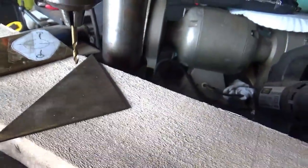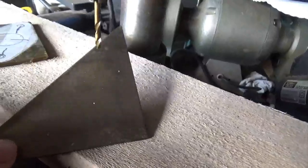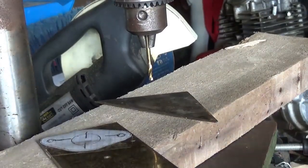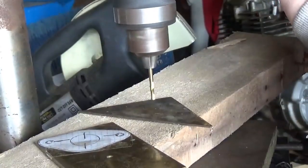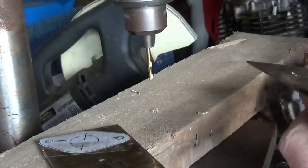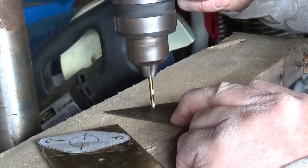I need to make two of these. By the way, when you're building these things, the bigger the piece of metal you start out with, the better — you're able to hang on to it as you're trying to cut corners off. A little triangle is going to be a pest, so if you start with a bigger piece of brass or copper it's just a lot easier. We have the drill press set up and ready to go. I'm going to start out with the center hole — I like using an eighth-inch bit to start. Once again you can see the problem with small pieces of metal: if the bit grabs it and starts whipping it about, it's hard to hang on to. My recommendation: get out of the way.